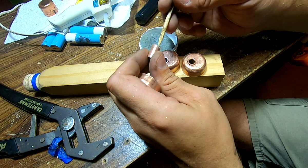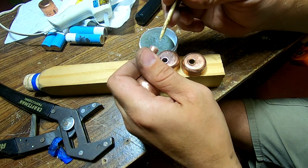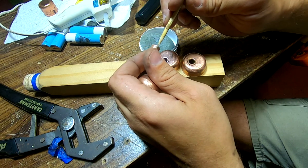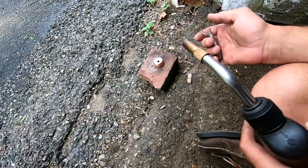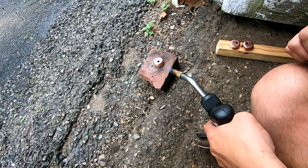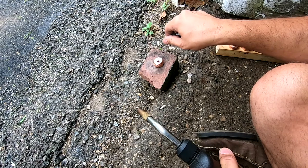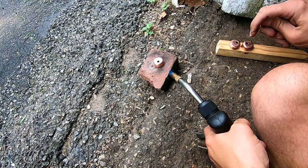It's important to clean the copper — dirty, oxidized copper won't solder well. Now for a little flux; the flux helps the solder to stick. I've used soft solder on preheat cups before and it was fine, but to be safe, you'd always want to use silver solder.